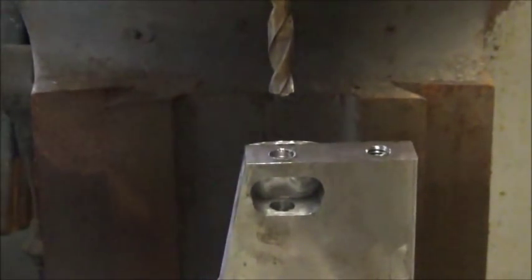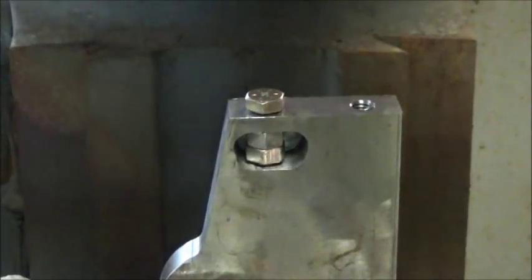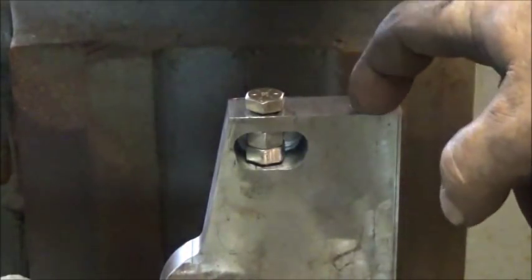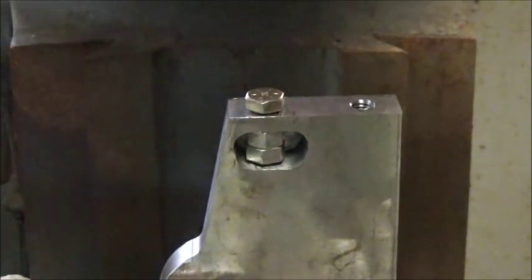You know what, if I keep this up I'm going to be a professional tap breaker — which I may already be. So what I done, went ahead and milled out the hole, busted the tap out, re-drilled it with three-eighths, and now we're going to fix it. I got the bolt in there, I got two nuts in there, now we're going to weld this up and hopefully the bolt will come back out and we'll have threads in there. I don't want to take the time to remake the triple tree because of that. I think my taps are just daggone dull — would be nice to have some sharp ones, so I probably need to order some.